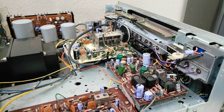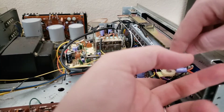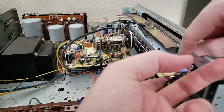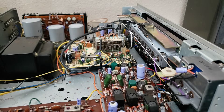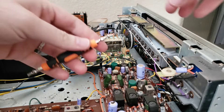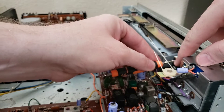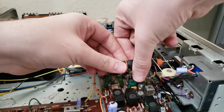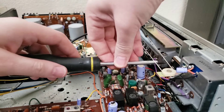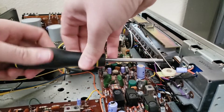I'm not really sure what the best route to approach this is. I might just try to put one of the screws back in to have it stay in place and then see if I can remove most of the solder with some wick or one of the desoldering vacuum pump tools.